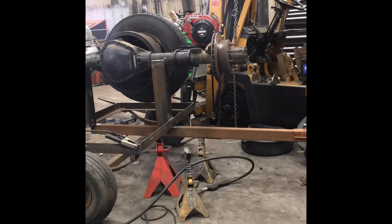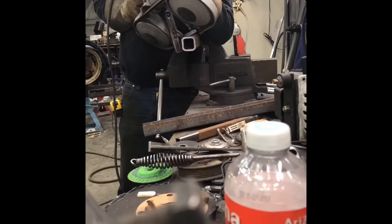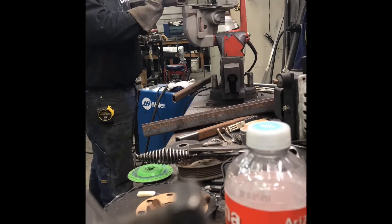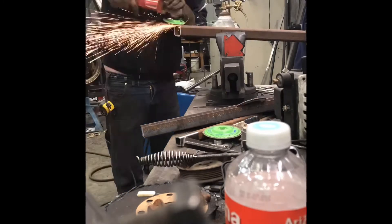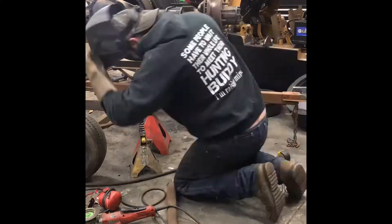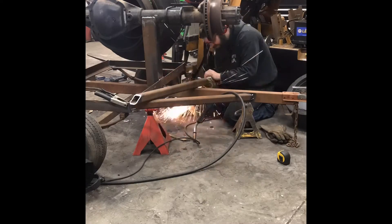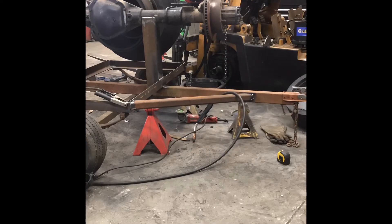Here I've got the tongue off of that old motorcycle trailer, getting it squared up, getting it locked down in place. I've got some piping I'm going to use for my angle braces. The bandsaw is just the best way to cut real nice clean edges, even if the vice is moving around a little bit. Get these angles cut in, ready for them to get fitted onto the trailer. Now that the tongue is tacked into place where I want it to be, you can see I spend plenty of time getting surfaces nice and clean. I think that's the best way to get real nice clean welds. I took my time here, made sure the angles are just right. This back brace I fought for a while trying to get it just right — ended up having to take it to the bandsaw and recut the angle a little bit more because I was a little off, but ended up getting it finally cleaned up and in position the way I wanted it, tacked in place and ready for welding.